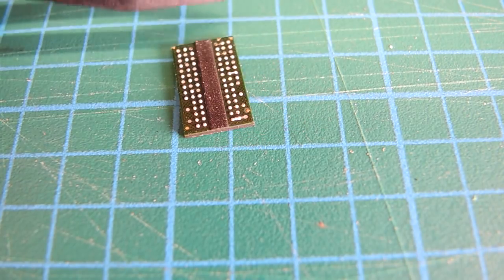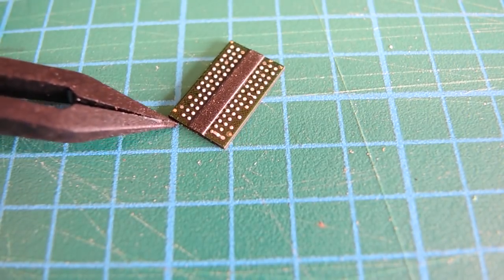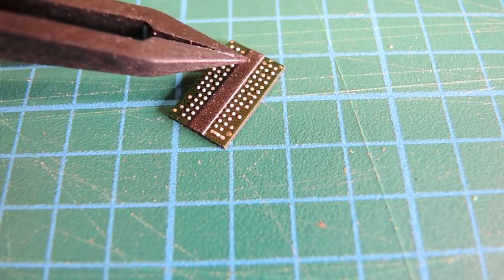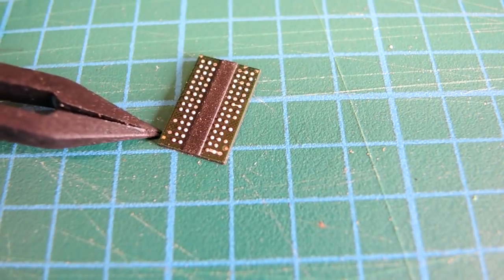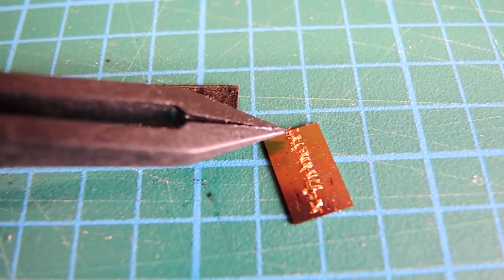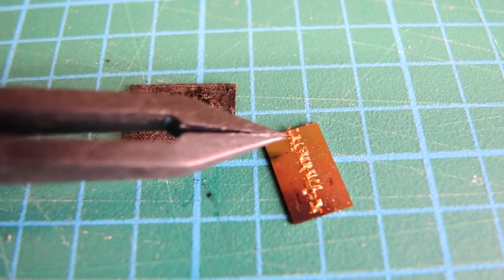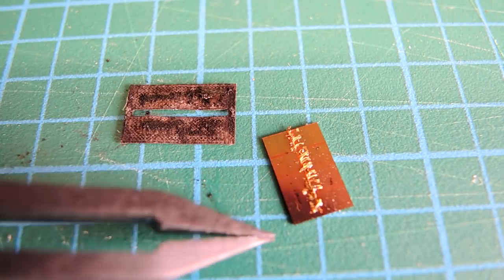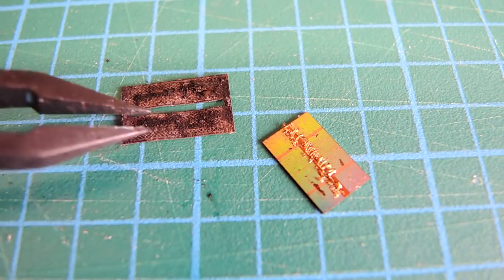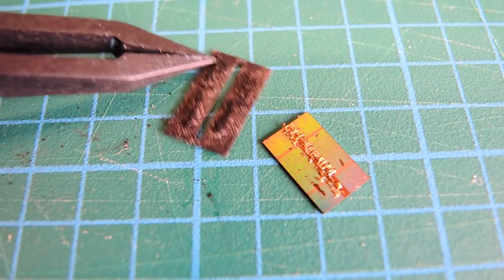What's extremely unique about DRAMs is they have something called a center bond pattern. If you look at the substrate closely, you can see there's a stripe here. Rather than being the fiberglass material you'd expect of a substrate, this is actually hiding some bond wires. They do that to reduce the amount of capacitance and length of the connections — if they put the bonds on the edge, you'd have to go across the die to reach the memory arrays. We can see the substrate, which is a fiberglass matting.